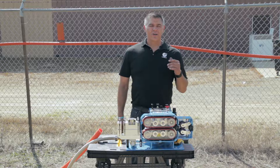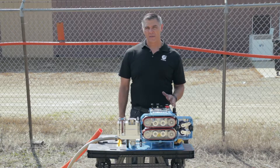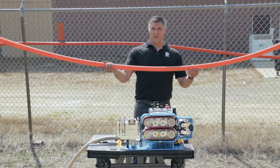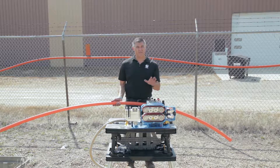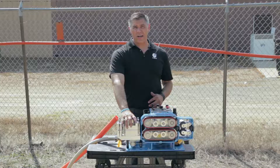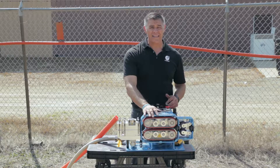Crash testing is one of the most important things you can do when getting ready to blow fiber. We're going to use a scrap piece of duct — about ten feet long, though five or seven feet works fine — and run bare fiber through it. We'll use only the tracks, no air into the air block; we're just using the air to run the tracks and the speed.